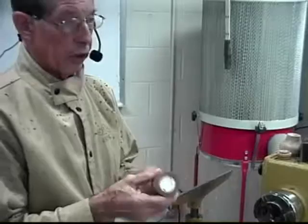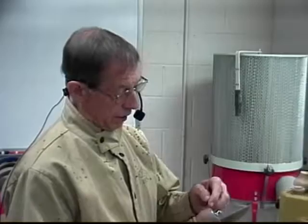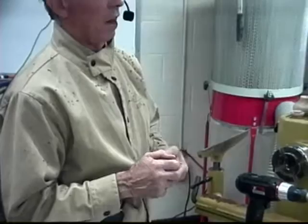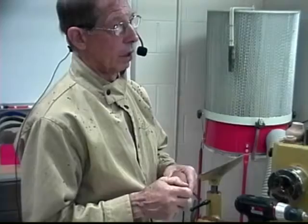Any questions on that? Yeah. I use the wipe-on poly, the gloss. I put on 6 or 7 coats. And the other thing is, when you're polying it, you've got all the kit out. And then if you get 5 or 6 layers where the cover goes, it gets pretty snug. You wind up having to sand that back a little bit, and even where that insert goes for the 1.5 inches, you might have to sand back if you get 6 layers in there. Even though it's wipe on and thin, it builds up a little bit. So just check it before you try it. Right now it's a good fit, but you put the poly on and it gets a little thicker.